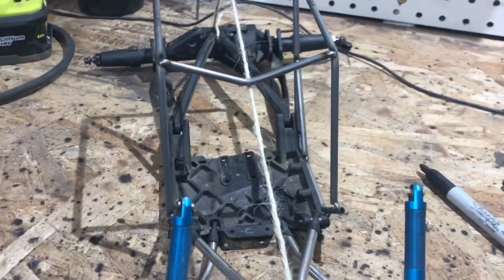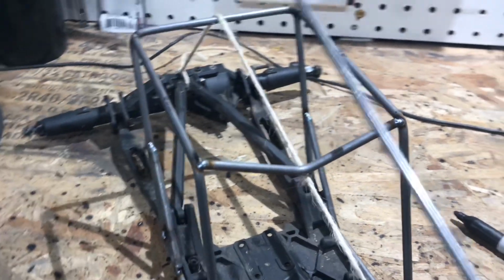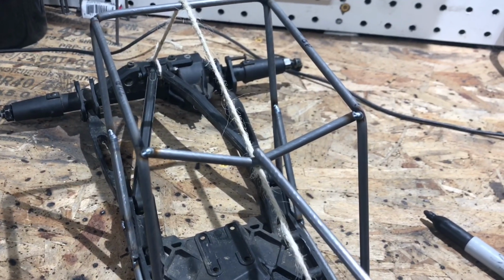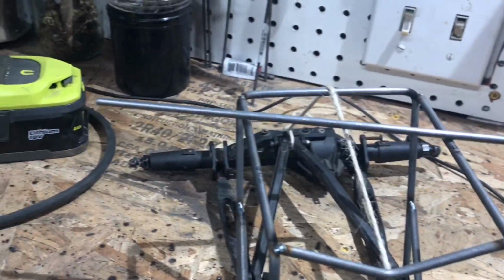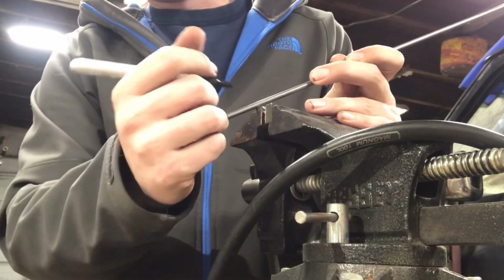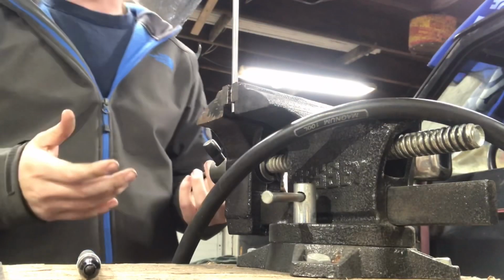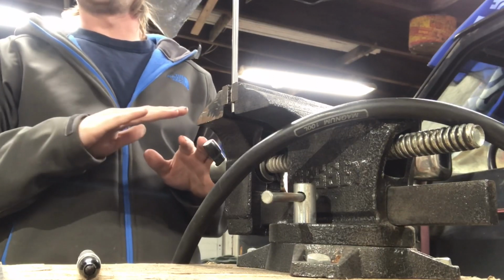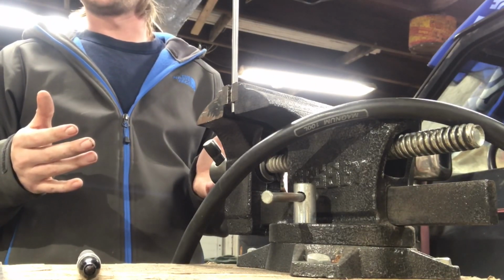So next what I'm going to do is the roof bars. I'm going to do one like this and one like this. But right here it's going to have a little bend up before it gets flat, so then it's flush with the top. The way I'm going to do this process is I'm just going to make a line to where I think it might be, and just guesstimate on what kind of bend you want. I'm going to go for a real laid back one, so it's going to be more of like a maybe 30 degree instead of like a 90 degree.